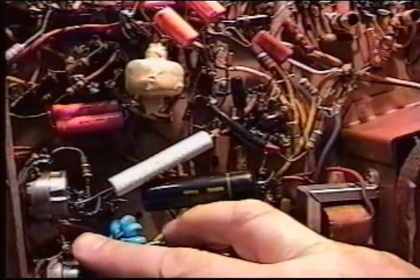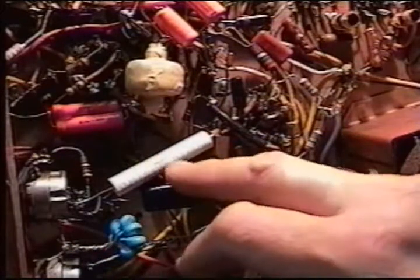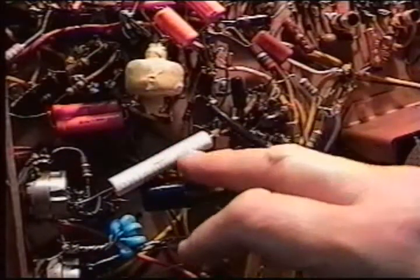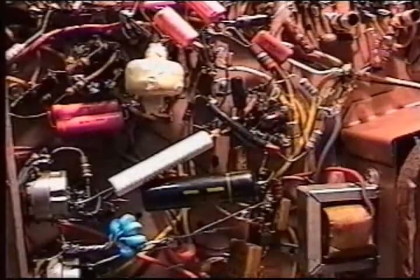This is a coupling capacitor for the horizontal circuit. What we are replacing right now is the vertical. This is all the parts that I have, and when we're all done and we replace these, then we should be in business.